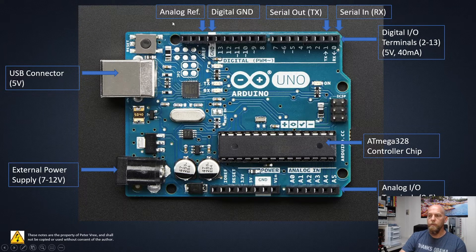There may be some points where we look at an analog reference voltage, making use of this AREF pin. Just make sure you're going into the appropriate terminal as you're connecting everything up. I mentioned that you can reset your program by either pressing a push button or by sending a signal to the reset pin — if you set the reset pin low, to zero volts, it will reset the program. The other way is with the reset push button, which will restart the program from the beginning of the loop.